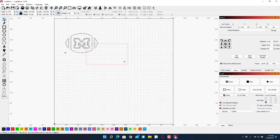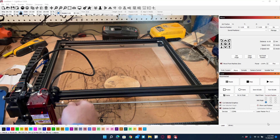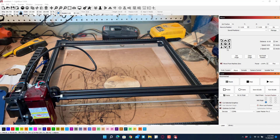One of the nice things about LightBurn is I can build anywhere in the work area. I'm going to set mine in the middle, then when I connect the laser I'll use the job origin from current position with the bottom left corner setting. I'll raise it up because I know how much taller that piece of material is. Now let's home it - hold down Shift and it'll go twice as far. Mine wasn't moving because it was on COM 6 instead of COM 3.